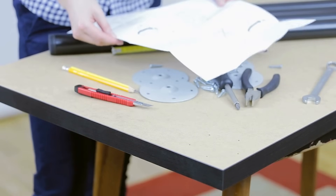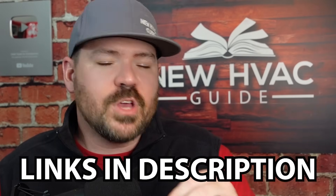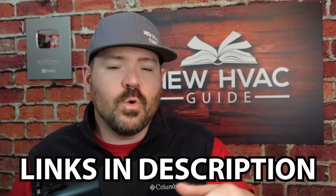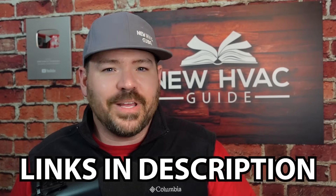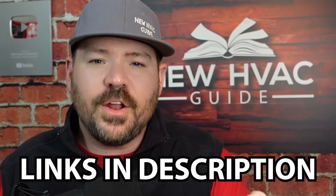That's basically how you do it. If you don't have a Sensi, if you've got some other brand thermostat, go into the instructions to program it. If you'd like more information on the Sensi Touch 2 or the Sensi Lite, there's a link in the description where you can get more information or purchase one. No matter which thermostat you have, you should be able to switch from O to B or B to O, and that should get your system to blow cold or hot depending on the season.